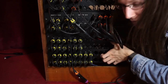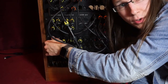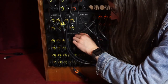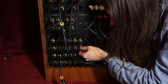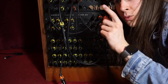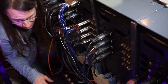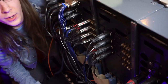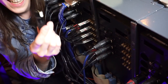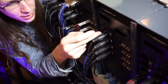The outputs and inputs from the MOTU don't travel far — they go to this bottom patch panel, where I have outputs and inputs so I can patch things in between. I almost never use it, to be honest — the cables are practically rusted in place. From the patch panel, a blue Van Damme multi cable runs to the back of the console. The audio from the MOTU goes into a channel on the console — in this case channel 9 — via XLR cable into the line input. I only have line inputs, no preamps in this console.